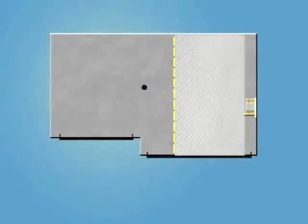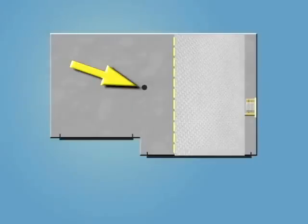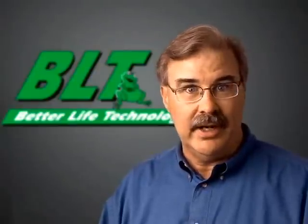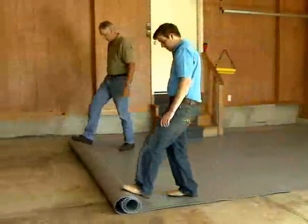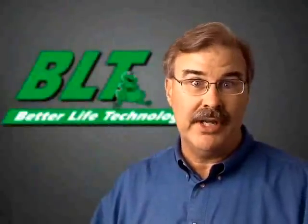The manufacturer recommends that as you begin, you find the center of the garage or room and place one seam along that center line. This usually assures that a vehicle tire will not end up on the seam. This is also a good time to locate a support pole or a floor drain, as these could determine your final layout and where seams are located. One place you don't want a seam is the area in front of the door that leads into the home or office — you'll want a clean run of G-Floor in this area. If the customer has ordered a drop installation, there are no seams; simply unroll a single roll of G-Floor where the vehicle is to be parked.